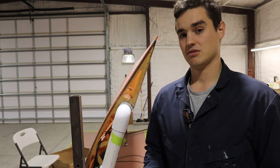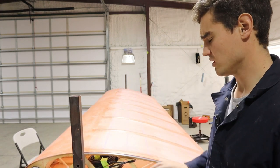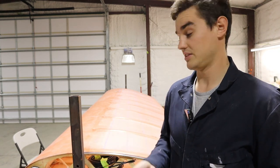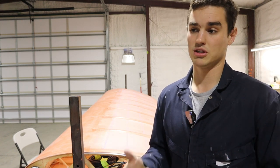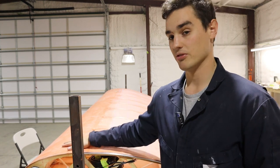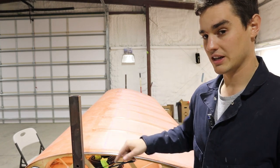We're going to focus on other things I did with the wing. One thing I had to think about when covering was the Laker leading edge — it's not addressed at all in the covering instructions, which are just for a standard wing. This is an STI wing with a Laker leading edge, and those introduce confusion about how to cover the plane. I just got off the phone with consolidated aircraft coatings — Polyfiber — about how to cover this leading edge, which I wish I had done correctly from the start, but now I'm chasing my tail trying to fix it.